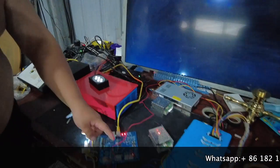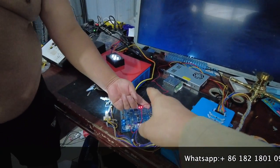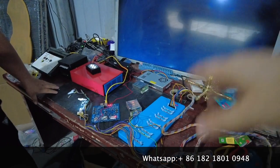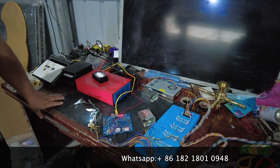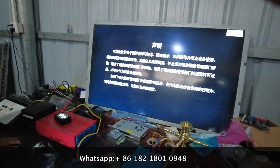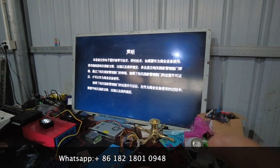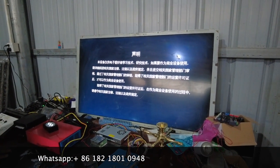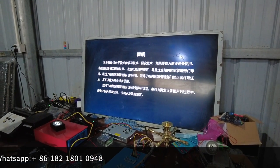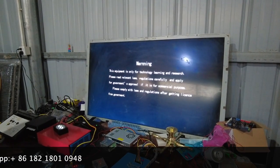On the flagging boards, the red cable must be connected to 5 volts — never 12 volts or 24 volts, only 5 volts. Right now we are restarting the game to see what happens since we already set the refund type to coin, to check whether it works or not.